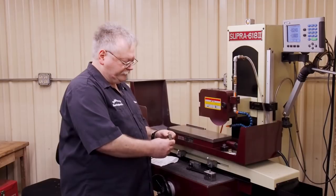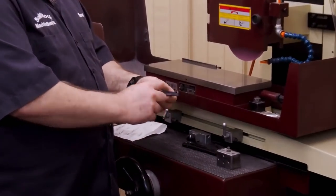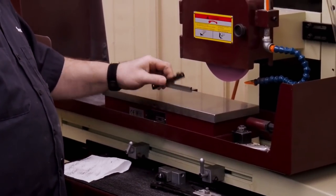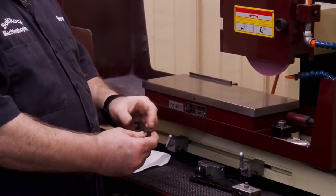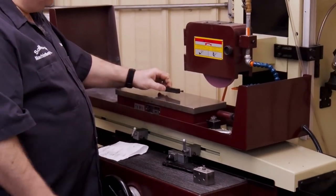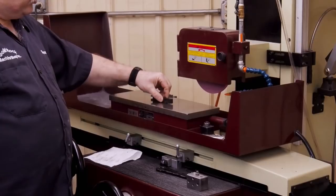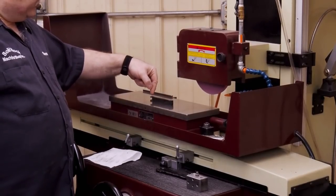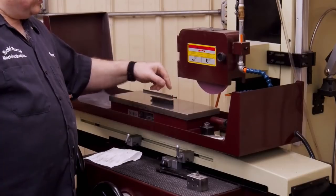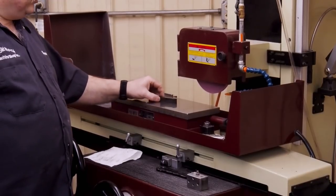I generally like using wider surfaces, but because of the shape with the radiuses on this part, there's really no way to hang it that way. If you flip it over you'd have to put flats on there and it won't hold. The surfaces are pretty close, so I'm just going to start grinding. I'm going to hold the part at an angle because of its length — holding it straight, as the wheel hits the steel it generates heat over the whole length, giving it more opportunity to cause a heat warp.